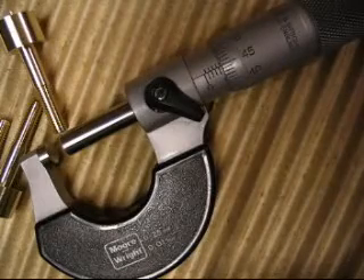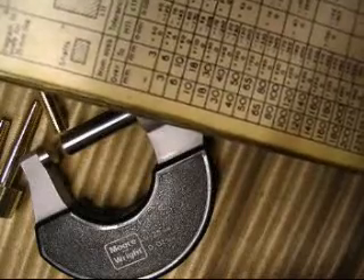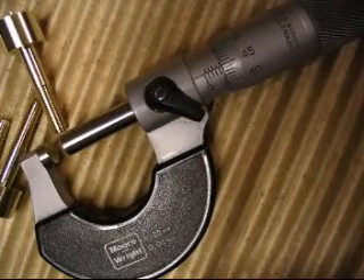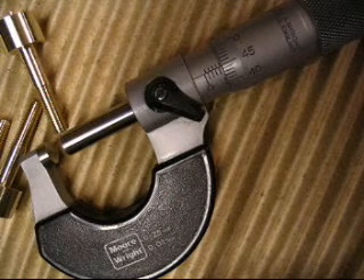You can get all sorts of things. I've just found this — it's a little engineer's pocketbook. According to BS4500, which I would have done at Technical College 30-something years ago, here we have a system of limits and fits, where it shows you that in large diameter articles you need quite a large tolerance, or you could accommodate a large tolerance. And on smaller sized articles, you would need to work on a finer tolerance, possibly for such conditions as an easy running fit, a close running fit, a light press fit, or a heavy interference fit, whatever you want to work on. Those are the old-fashioned terms.